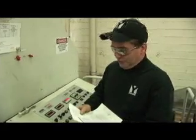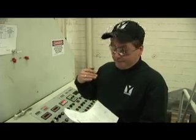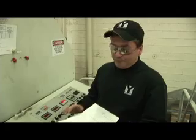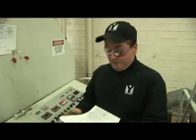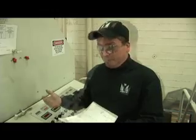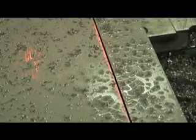We've already staged our material. It's three-eighths thick. I'm putting two plates on and cutting it in half. This way we can double it up so it's four plates thick, which is an inch and a half, which will cut down the cutting time. After the trim cut, we're lining up our laser with the size that we need. The laser is within a sixteenth of an inch.